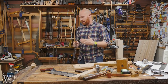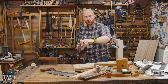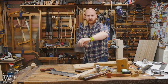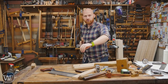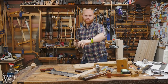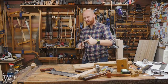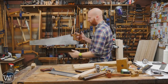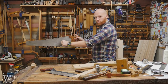That leads into the body mechanics you have to learn. Keep the saw in line with the arm, in line with the elbow, in line with the shoulder — so that the whole shoulder, elbow, and everything runs in one smooth plane. If your elbow goes out of line, your saw starts going sideways and the cut won't be straight. Keep your body out of the way too: too close and you do this, too far and you do that. The whole saw needs to be in line with the arm and shoulder, with the weight back on your wrist, so you can balance it between your middle finger and wrist while cutting.